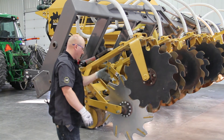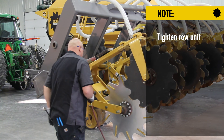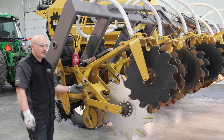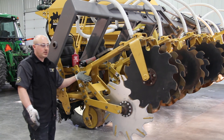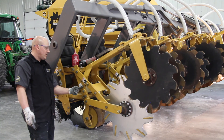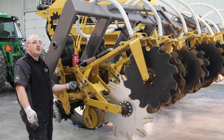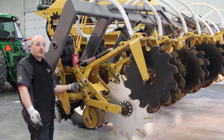Now the last and final thing is to take your CC arm — you'll need assistance or a forklift handy to take a little pressure off your CC tube. You'll pull the shell where your shallow tillage placement bolt is, slide it out, move it up one hole to the deep tillage placement, then re-apply your lock nut and you're ready to go to the field.